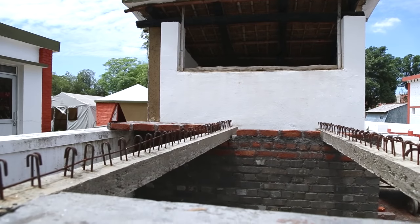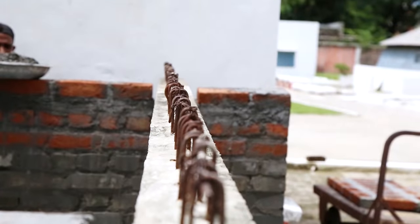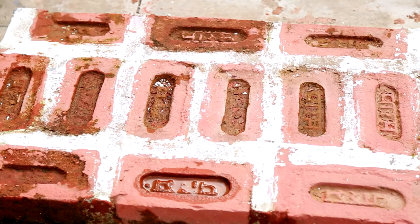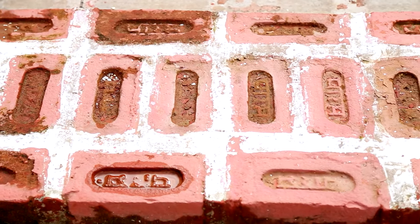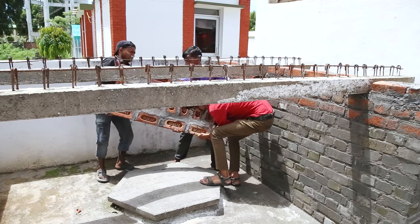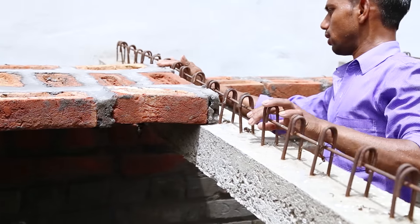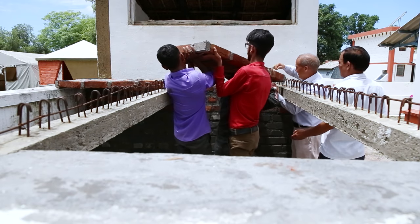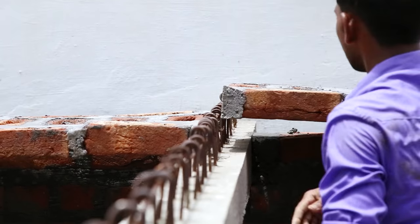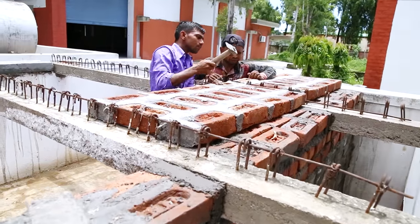For assembling the roof or the floor, first of all the RCC joists are placed on the walls. The brick panels are cleaned with a wire brush to remove dust, loose sand and soil particles. They are then lifted and placed in position over the walls and between the precast RCC joists to make the roof. The joists are placed over the concrete bed blocks and are properly levelled with a 1:4 ratio of cement and sand mortar.